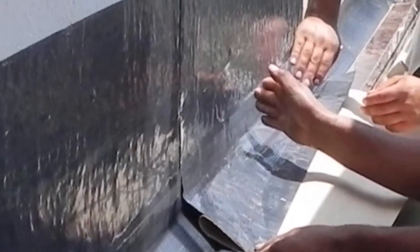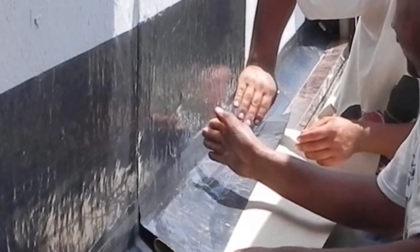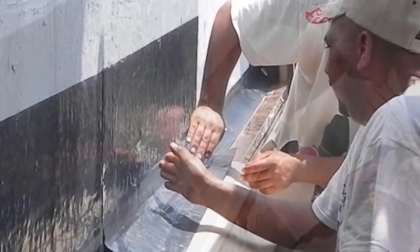After the wall and ledge were flashed, the installers applied pressure over the face of the flashing with a rubber-surfaced roller. This flashing demonstrates full adhesion, as indicated by telegraphing of the substrate irregularities. Full adhesion like this is made possible by the split-release paper that Polyguard provides on its 6, 9, 12, 16, 18, and 24-inch flashings.